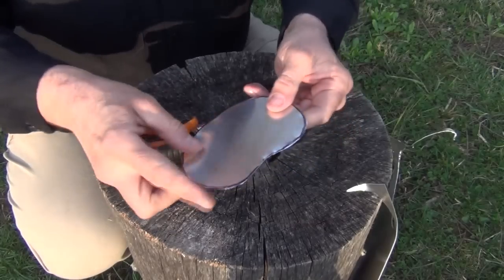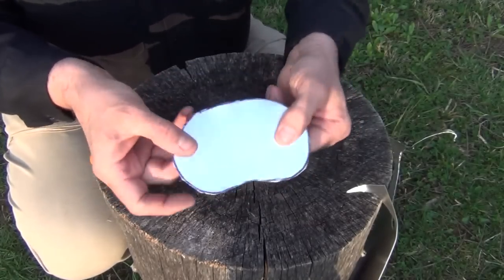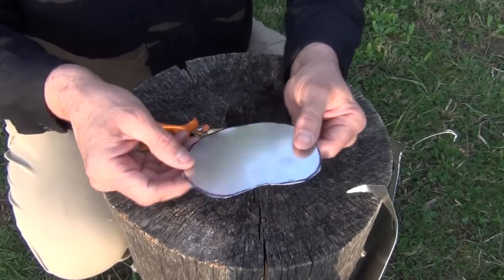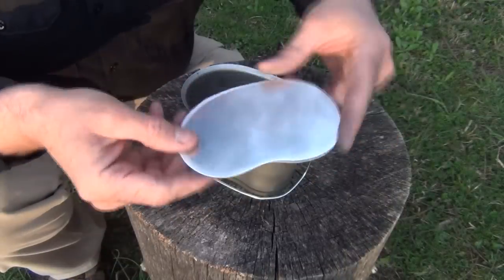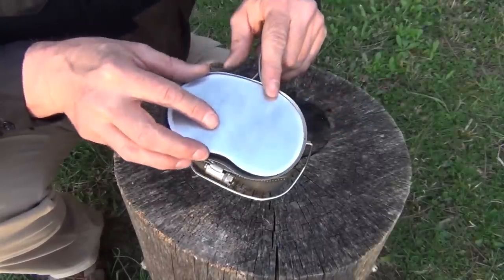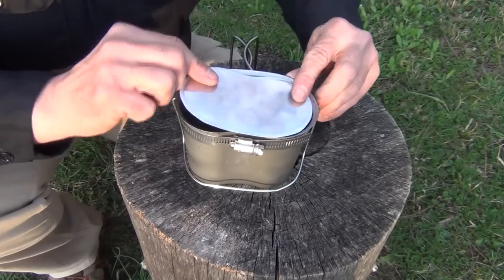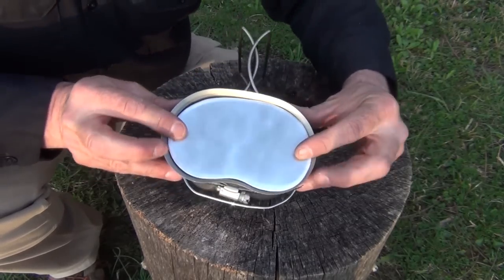Alright, so we have this. It's got some sharp edges and it's not very symmetrical. So I'm going to put this on a belt sander — you could use a Dremel tool with a grinding wheel or a file — but we're going to clean up all of these edges and test fit it on the cup to make sure it fits properly. After we get it cleaned off and deburred on all the edges, we want something that fits just inside the cup, just like that, with a little bit of the lip left over. This doesn't have to be exactly perfect, just so it fits pretty well.